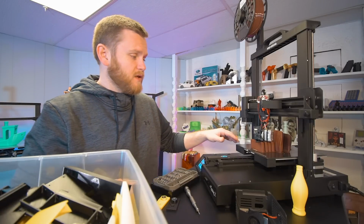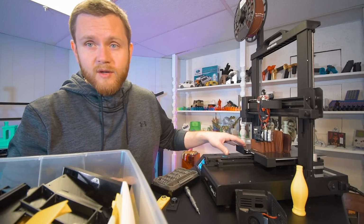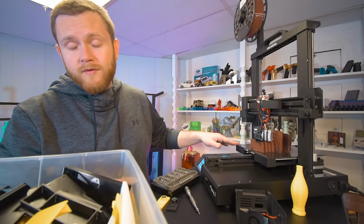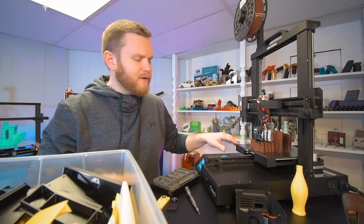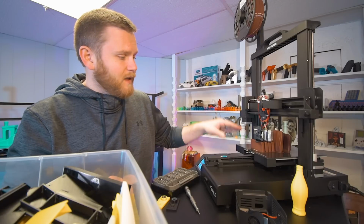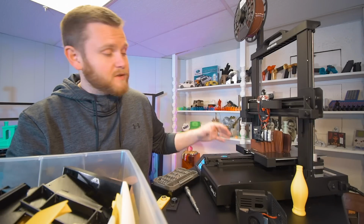I'm going to flip it and just use that side, I think, because I'm having a really hard time taking prints off this thing. I would have to put them in the freezer, wait about 5 minutes, then they do pop off if I hit them with something a little bit and get a razor underneath. But if you keep that up, you're definitely going to damage the surface anyway. So definitely super sticky, and honestly having it stick is probably better than not sticking at all. So not so much a negative, but worth noting on my particular machine, it is some of the stickiest surface I've ever come across, which is interesting.